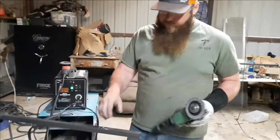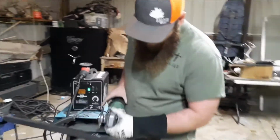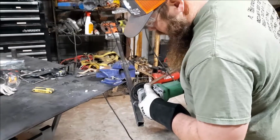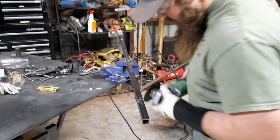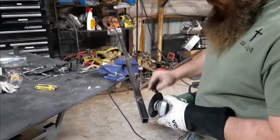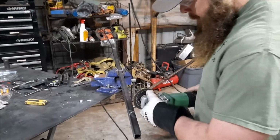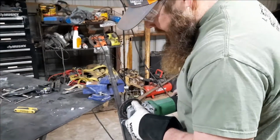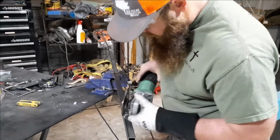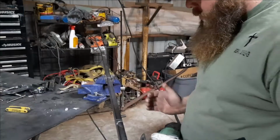All right, now with the grinder, come over here. With this grinder, when you go to do that radius, you want to push towards the inside, because all this is just material that's going to be removed anyways to make that bend. So you're going to want to follow that radius real smooth and rotate towards the inside, so that you make this part rounded.